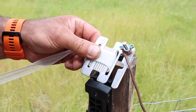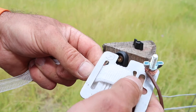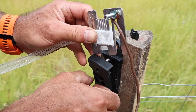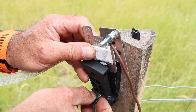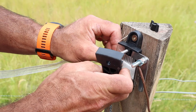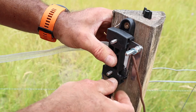The live from the box is this wire here — the brown wire — connected to a little metal plate that's basically an interconnect for the wire fence. I've wrapped this round a couple of times, it'll now go into this little plastic insulator block. The insulator block then compresses it and that's our connection.